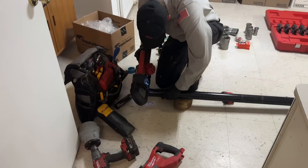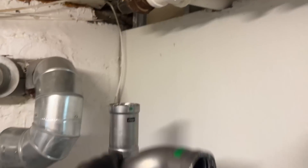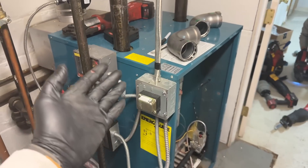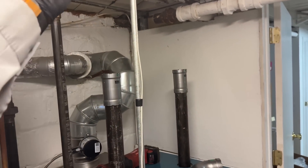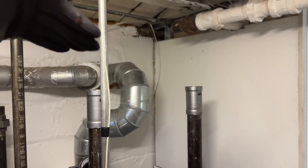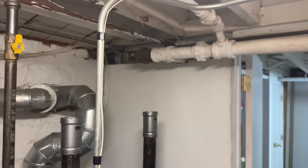We're going to extend this 12 inches, which puts me right around there. We want really dry steam — if we keep the header too low, that violently boiling water, which you think is right at the water line, is actually all the way up here. The higher we make this, the less likely that boiling water reaches the top. The purpose of the drop header is to come back down and make its way back to the equalizer on the return side.